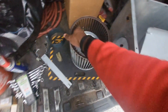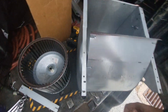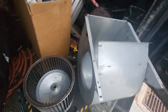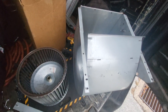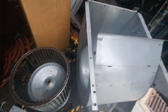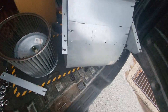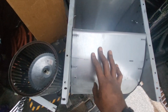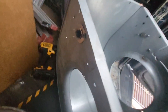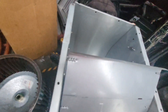Welcome folks, this is another service call. The customer called a few minutes ago and said the furnace wasn't turning on, but when it did turn on it was making a weird scraping sound. I turned the system off, but before I did I was able to look at the fault code. This came out of a Goodman furnace and the fault code was error code 6. On these 90% Goodman units, error code 6 means either the fuse is open or you have a rollout switch open.